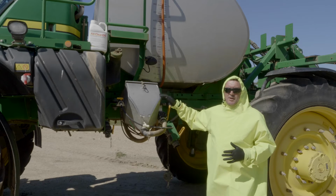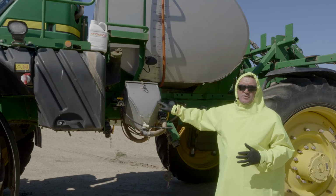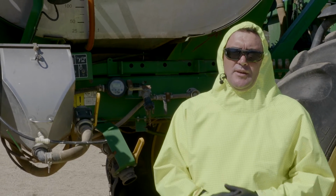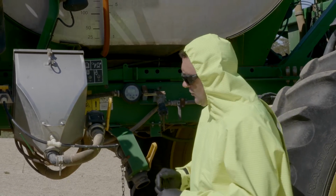Because if I do that, I'm only going to force more dirty material into the sprayer. If I reverse it back through the drum rinsing nozzle and fill the hopper from the main tank with the cleaning agent and then drop it to the ground, I've actually made the sprayer a little bit cleaner before I go into a full decontamination process. So I'll just pull the hopper down.